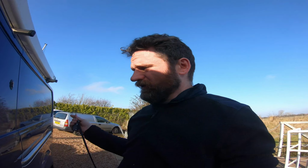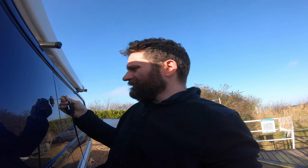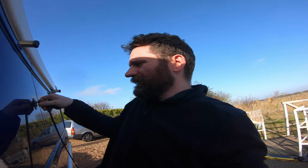Check on this Beta Marine that we checked over before. I've got here just a little bit earlier than the tide, but it's in. I can get down there, get the engine started up, give it a quick test. The only thing I didn't do last time was a CO2 test. It's smoking a bit, so I just want to make sure it's not a head gasket or something like that. If it's just the injectors, then they can be removed and sorted out at a later date, or whatever the customer wants to do. But let's get unloaded and get on with it.